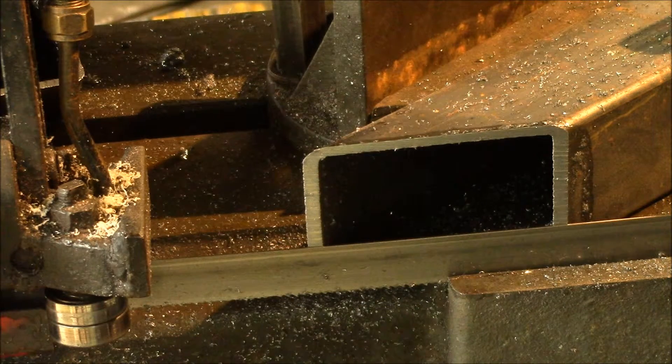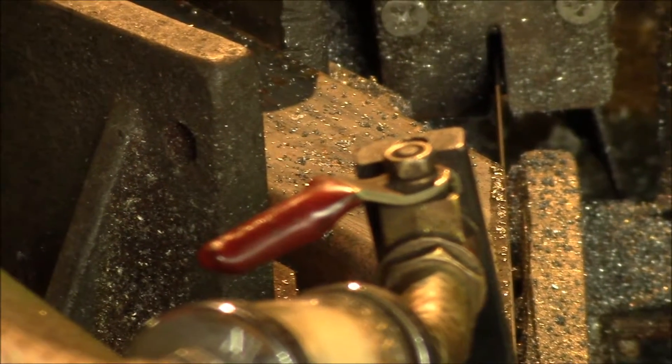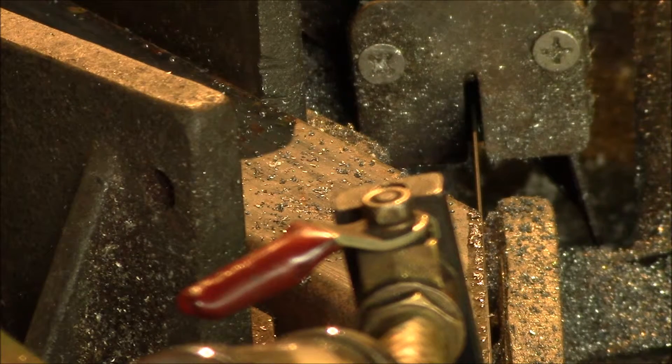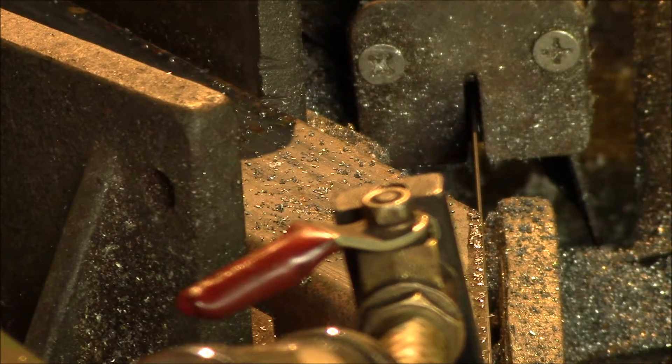That's a pretty handy little thing for a horizontal bandsaw — if you're looking for a shadow line where the blade's going to cut, set up a little LED spotlight. I'll show you how it's lined up: looking down the saw blade, I can swing right up here and hit the light. So that's a perfectly lined-up spotlight. If I swing straight down, I come right onto the blade. Get your light shining right in line with the blade and you get a nice crisp shadow line, lined right up with the axis of the saw cut. That is actually better than I hoped for.